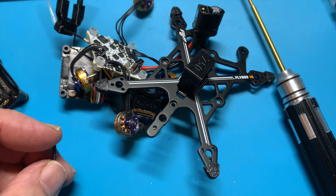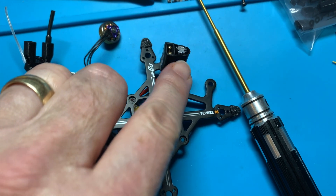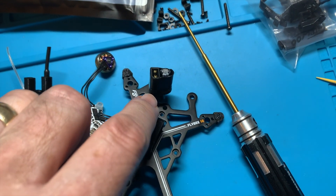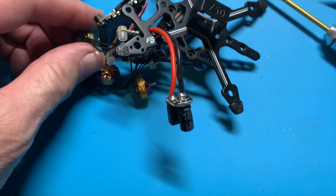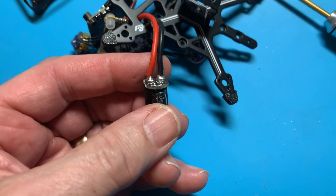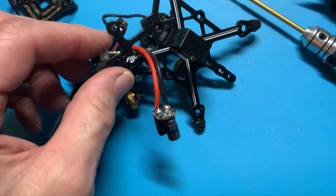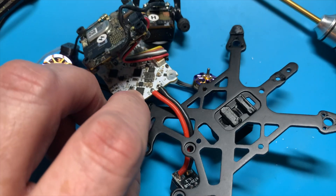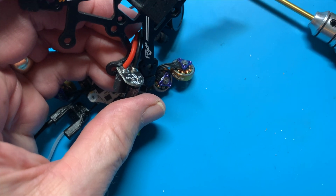So that's a bummer. The other issue is the pigtail doesn't fit through the hole, so I'm going to have to cut the shrink tubing off and hopefully once that's off I can just slide it through. Hopefully I don't have to desolder this. I have good news and bad news. The good news is the motor wires are going to be plenty long enough for the new frame. Bad news is this pigtail has a little daughter board here that connects the low ESR capacitor to the battery leads, so I'm going to have to desolder it from the board.